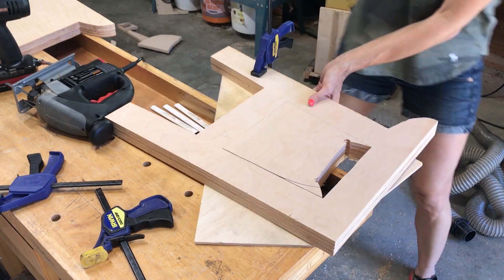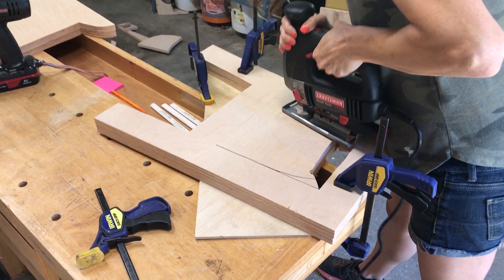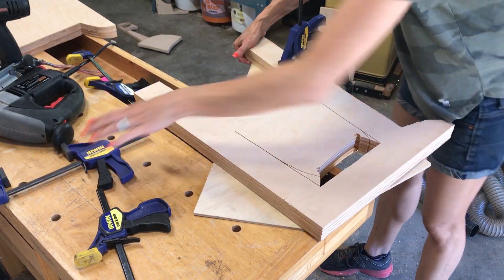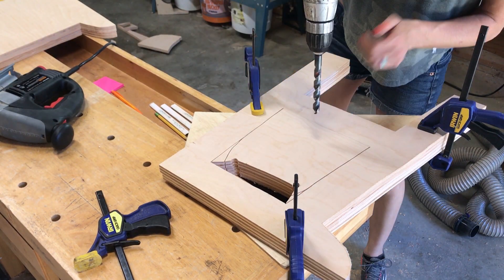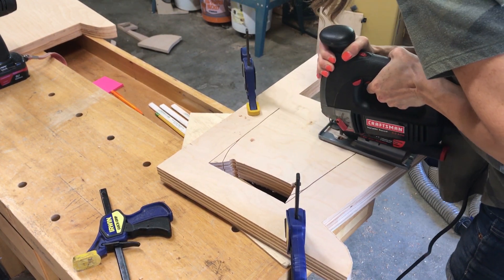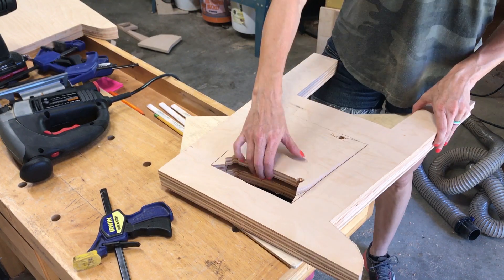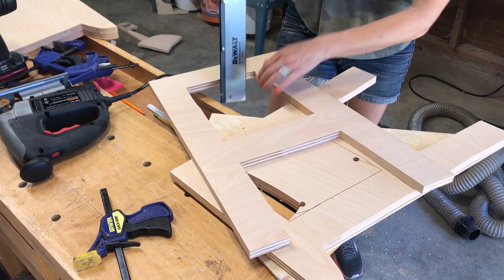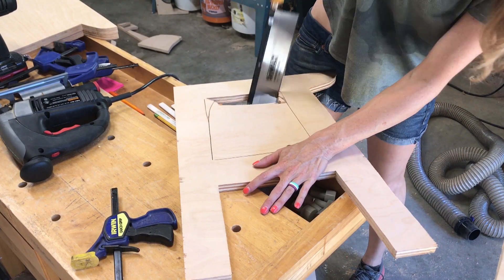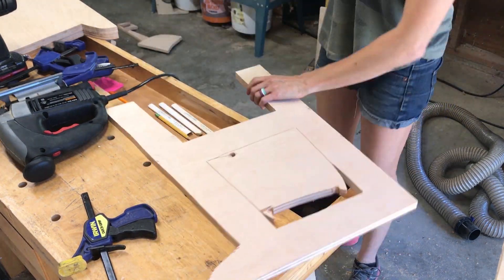The nice thing about this design is how solid it is. The sides are made out of one piece and even though I cut some designs out, it is still a full panel which prevents rocking. The front support runs almost halfway down the desk, which gives it a lot of lateral strength. The arc in it provides design and space for the legs to move freely. This was my first plywood project and it's gone a lot more smoothly than I expected. I was also skeptical of how it would look, but I'm actually really happy with them and I may try a few more of these projects.